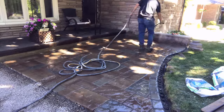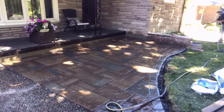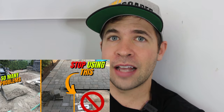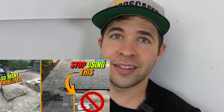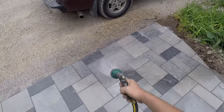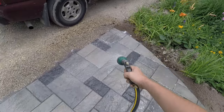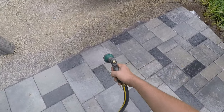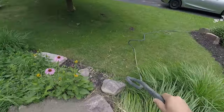If not installed properly — particularly during the watering phase, the consolidation phase, or if stone dust is used as a bedding layer or base material (which you should not do) — this will cause failure of the polymeric sand, which can be very expensive given it's three to four times the cost of jointing sand. However, polymeric sand has been embraced by the industry over the 20 years it's been around, and manufacturers now offer upwards of 15 to 20 year warranties on their product if installed properly.